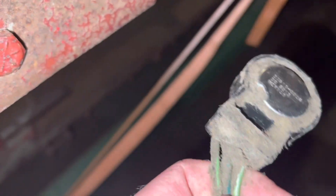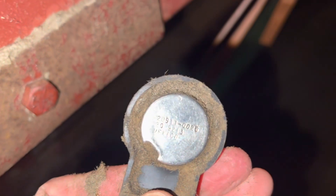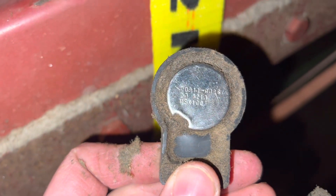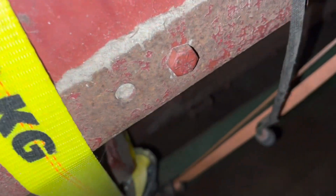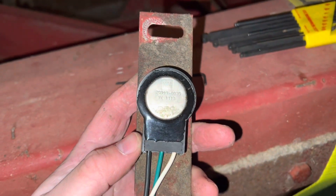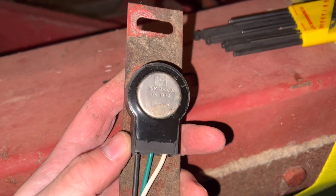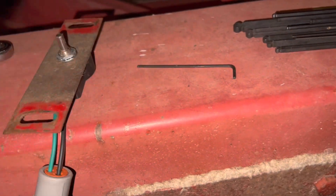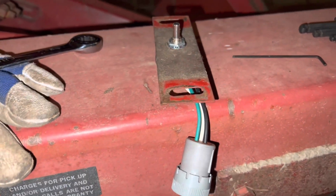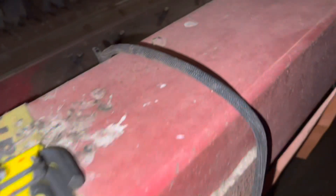Well, it'd be the right one for a 16 series. If we look at the numbers: 291100-26 with a 20 there, versus 2911-00301 — so it is a different number, a different potentiometer. The other reason I was 99.9% positive this was the incorrect one for my combine is that the farm I bought this header from has a 1640. So if their 1640 is all original, which I'm sure no one would go backwards with parts, that is the original 16 series harness — another reason why we needed to put the correct 14 series one in.